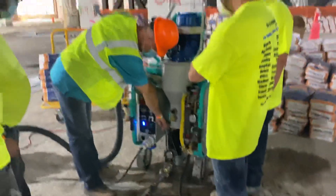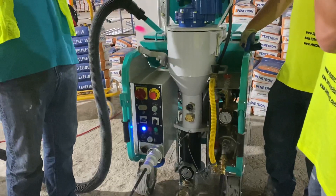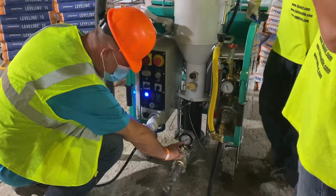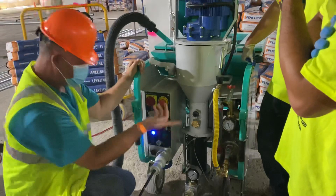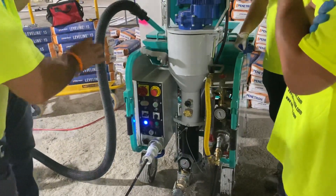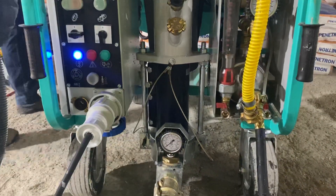You may want to adjust your rotor and stator later on. If the consistency seems a little off, adjust all three bolts evenly at the same time. Also, when you're pumping, watch your gauge here — if you get up to about 2 bar and the consistency is good, that's your benchmark. If weeks from now it's not the same and the gauge is down, it means you're not getting enough pressure. Adjust the three bolts evenly to bring it back up to where it was — just snug, snug, snug, all even turns.